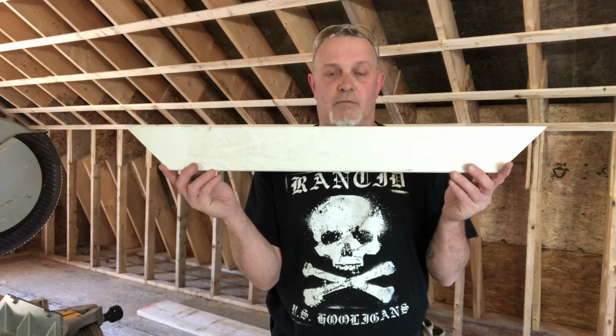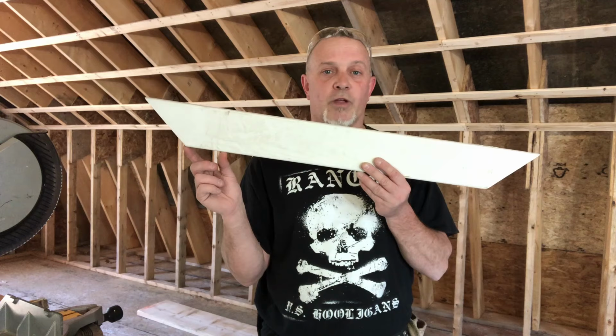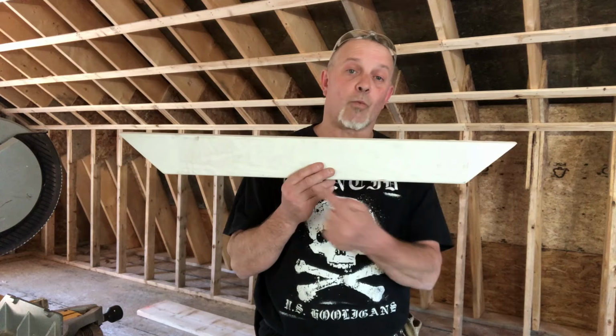All right, so this right here is 2 feet. 2 feet long, short to short, okay? If you do not know what that means, I'm gonna show you right now, okay? 45 degree angles on both ends, all right? From this point right here, this would be called a short point. And or if I went the other direction, say I'm walking this way, or I'm facing this way, this is called the short point, okay?